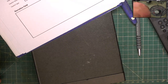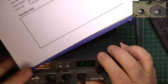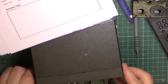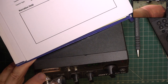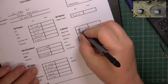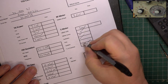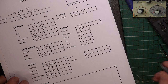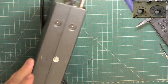And let's see what it's saying with 100 microvolts on for S9. It's saying 8.0. No, we've got to get a better reading than that. It is 200 microvolts. Meter lamp's okay, switches are okay, pots are okay, sockets are okay, internal speaker's okay, and mic supplied's okay. Oh, good. Well, wrap it up and send it off then now, can't we? Not so fast, Mr. 21.